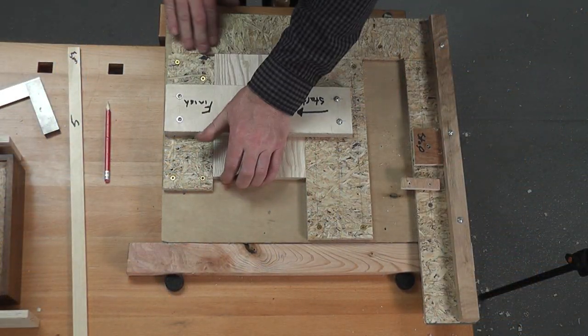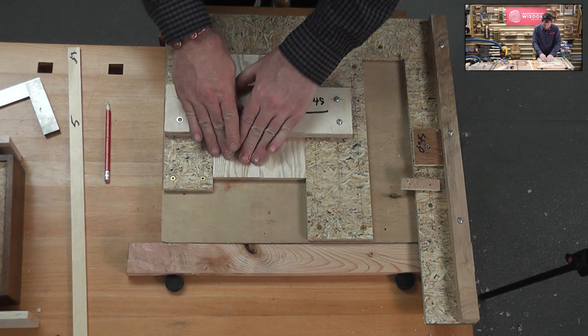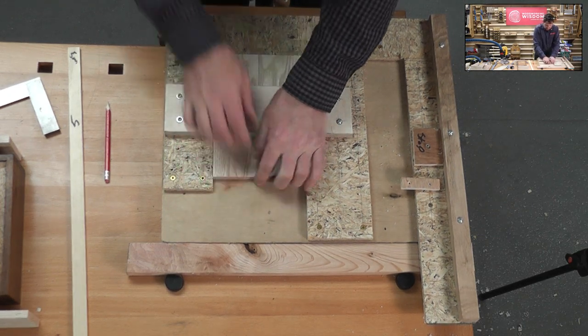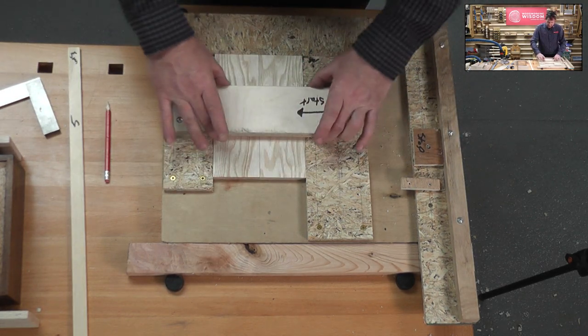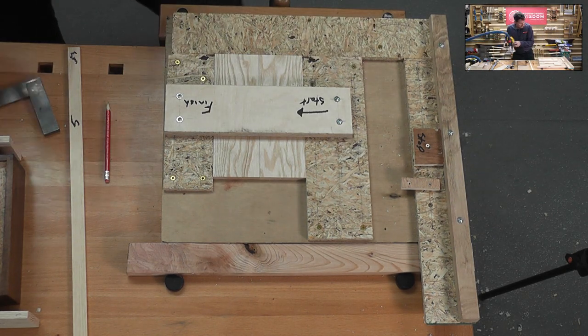There. Clean the dust out. Slide it down, check it fits nice and flat and square to this front edge. There's no point in having this one back higher. These should be flush on the back. Nice and firm. That fits in there nicely because everything's obviously pinching together. It's machined and made to go there. The bar's obviously adding a little bit of tension as well. So we're up to there.